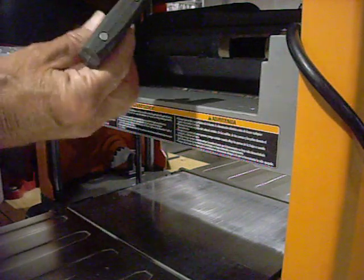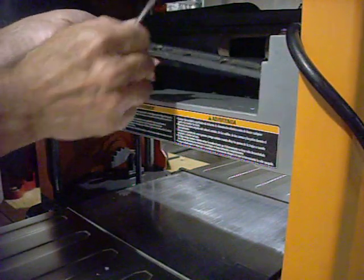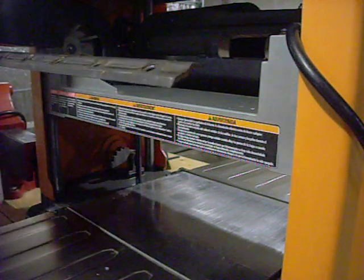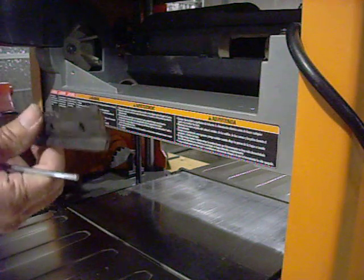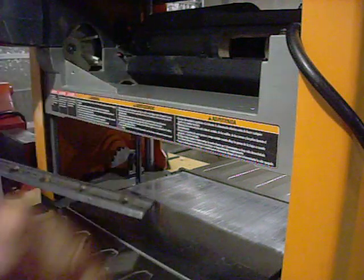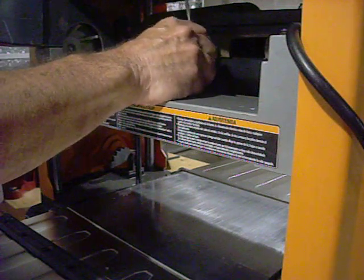This little tool here has two little magnets, which are decent for lifting the blade out — mainly for safety. You just lift this bar off that holds your blade in place. There's a little pin right here, so it fits right down into the slot on the blade. Then you've got these two small holes and they go into two metal pins back here, so you can't set it up wrong. Then you reach in, take your magnet, and get a hold of your blade.